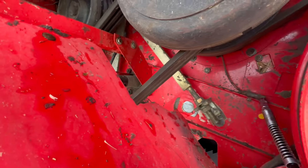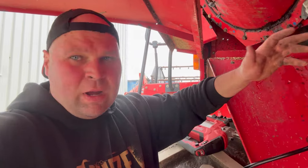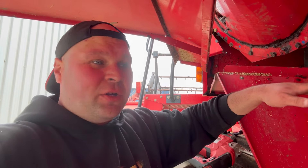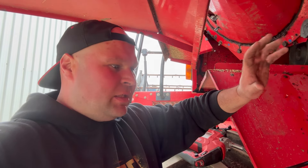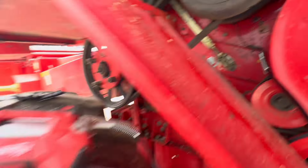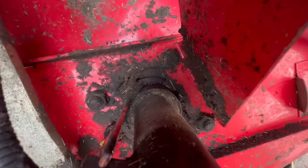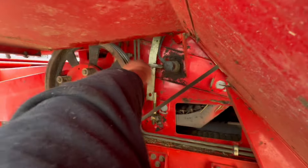There's more round here like that. It's really difficult to know where all these grease nipples are because sometimes you can forget — and imagine the amount of machines we've got. But it's usually not too bad, because any part where there's a moving part you'll usually find a grease nipple, unless it's a sealed bearing. This electric one is so much easier — don't have to stand there and pump it by hand. We don't want to put too much in because all the muck will stick to it, which is what we don't want.